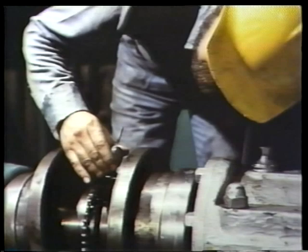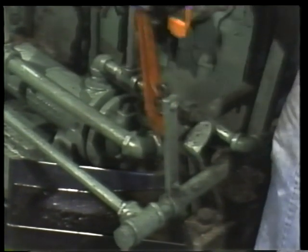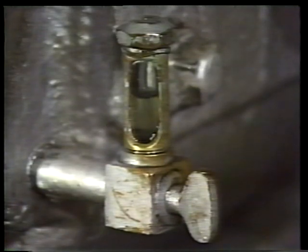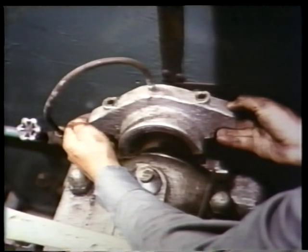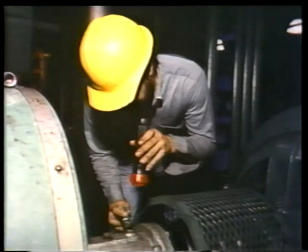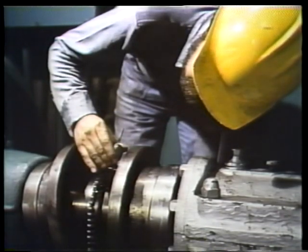Before starting up the pump for a test run, get the lubrication system in order: tighten the union on the oil drain pipe and fill the reservoir by pouring oil through the observation holes until the level reads midway up the sight glass. Then prime the journal bearing one more time and replace the plugs. Reinstall the gland follower, recouple the pump, report to a supervisor, and get the pump turned on for a test run. The test run will probably take a few hours. While the pump is running, check the bearing's oil temperature frequently. On the journal bearing, look down the observation holes to make sure the oil rings spin freely as the shaft rotates.